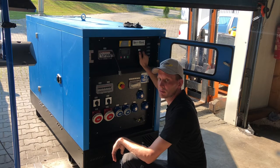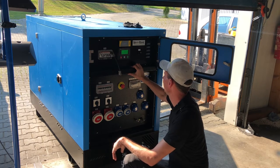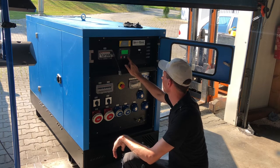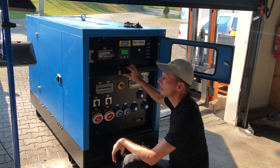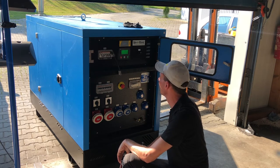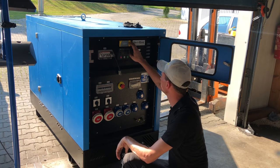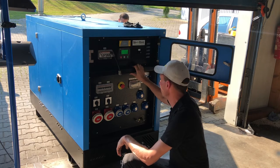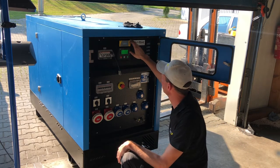So we start firing the engine. You need to switch on. You wait a moment. And then we go to start. See what happens. Still some air in. We need to prime out the air.